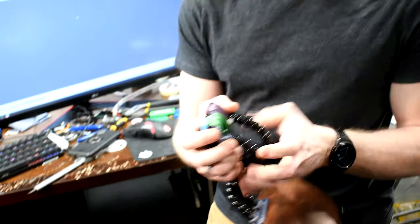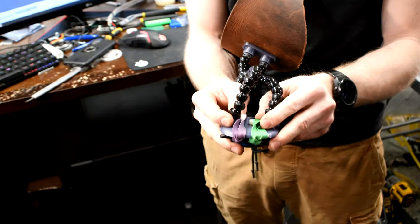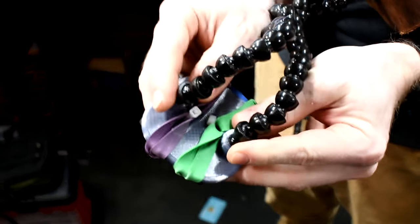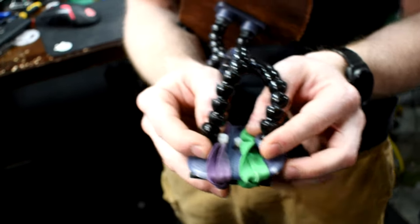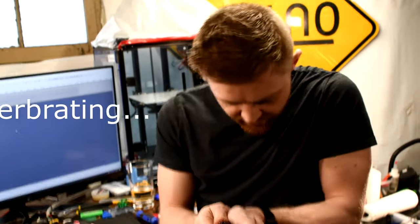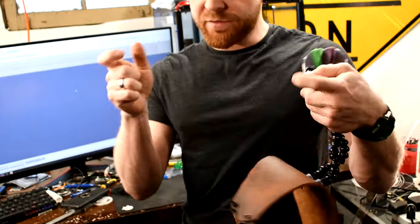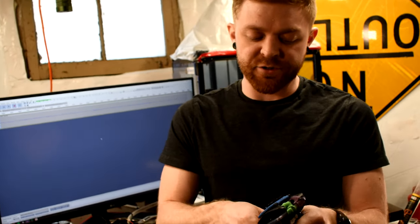These are loose. I should have made essentially — I'll show you how I made this, and I'll probably modify it. I had to basically make a sphere cutout inside of here, so I'll change the diameter of that sphere by half a millimeter or a millimeter and then they should snap in and have a nice amount of friction. Something else I might do is put a couple little ridges inside so it snaps into the larger sphere and the ridges hold it and make contact for friction.